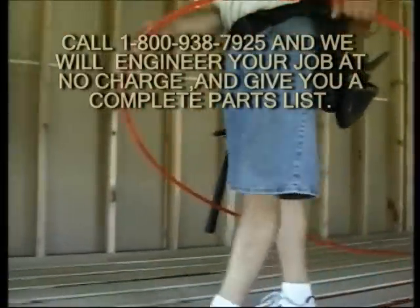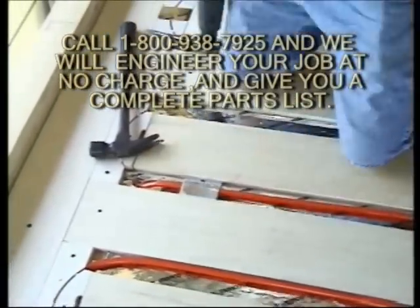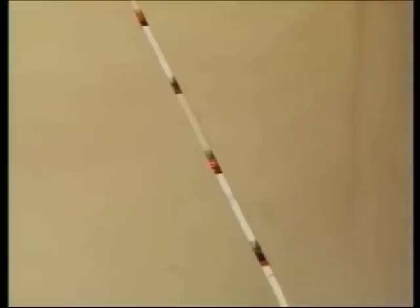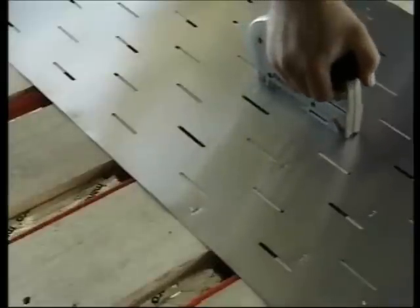When you need to install a second circuit, run one end of the tube into the groove and then start the second circuit from the groove in the next radiant channel. When the wood and tube are installed, roll out strips of perforated radiant conduction sheets perpendicular to the radiant channels. Leave a half-inch gap between each sheet and then secure them to the sleepers. Use these gaps or the openings in the aluminum cover to locate the tube so you don't damage it installing the next flooring layer.